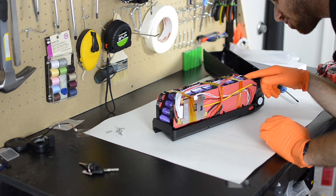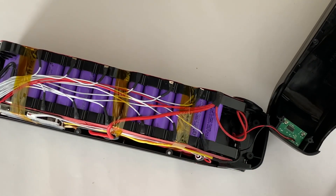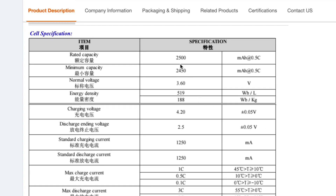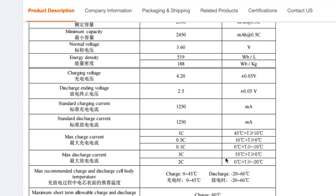It looks like they're rated for 2500 milliamp hours, or 2.5 amp hours, so assuming 4 in parallel — which is what we have here — we're going to be looking at 10 amp hours, which is what they advertise. I googled around and found these cells on Alibaba with what is purported to be the cell spec sheet. These are the 2.5 amp hour cells and the most important thing I'm looking for is the discharge current. The max discharge current for 0 to 55 degrees C is 3C discharge, which means at 2.5 amp hours these cells are rated for a max discharge of 7.5 amps. So 7.5 multiplied by 4 cells gives us our magic number of 30.